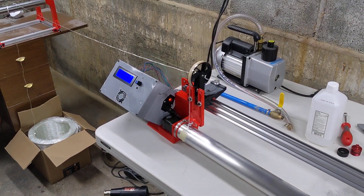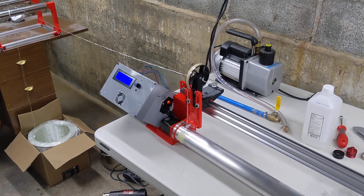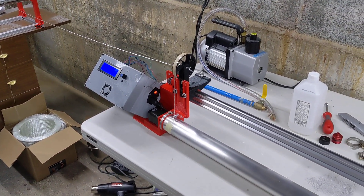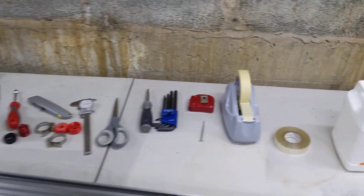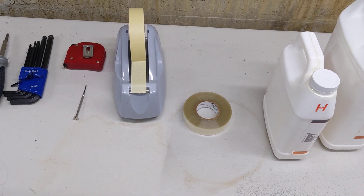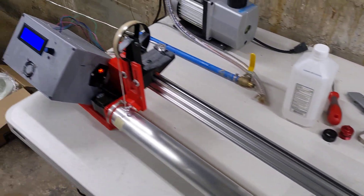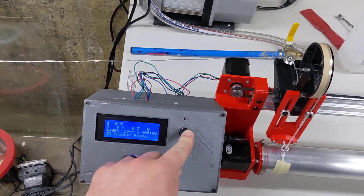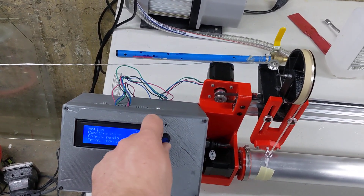It's going to be used for maybe a motor mount. I'm trying to dial in how my tubes are finishing — they're a little bit lumpy yet, but they're getting better. I have some 3 1/4-inch shrink tape that seems to be helping a lot. Let's get this running.